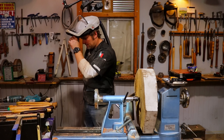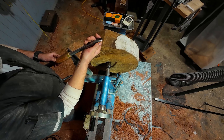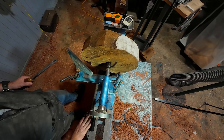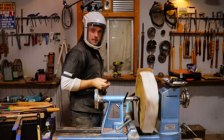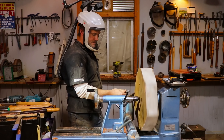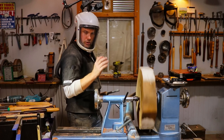Let's get going. First tool off the shelf is the 19mm Woodcut bowl gouge, sharpened at 55 degrees. First movement I'm going to do — I'm going to push into the face and clean it right up, get a blank canvas so we know what we're looking at.